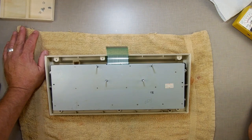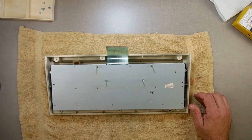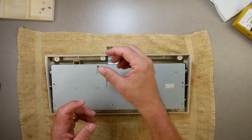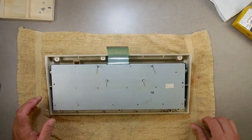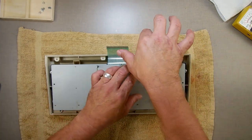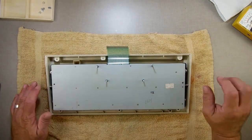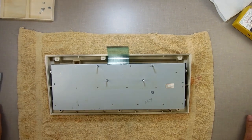And I wanted to do more disk drives. I had one drive, I believe it was an Indus or a Percom or one of those non-Atari branded ones. But if you looked at the back, it had an attachment to plug a secondary drive, a slave drive, into it. And I opened up the Atom and realized, you know what? I unplugged the disk drive mechanism from the board and plugged it into the back of the Percom. It became drive 4 of my Atari system. Worked great when I ran the bulletin board for a year and a half or thereabouts.